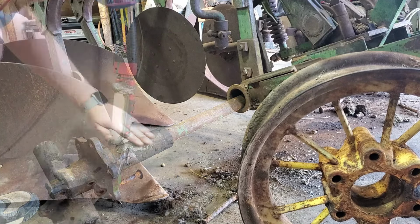And now I need to do a little bit of modifying to my power troll unit on my tractor, because since I have this 3-point hitch on here, you can see this bottom hydraulic attach point is blocked by that top link. So I'm going to go buy the plumbing I need to come out here with an elbow and come up here, and we'll put some more modern quick couplers on the back side of that, and then buy some hoses to run back here. And then hopefully we can see if this plow goes up and down.